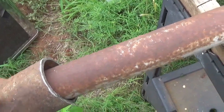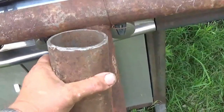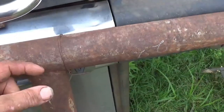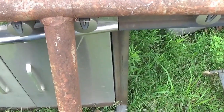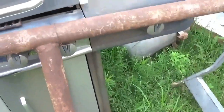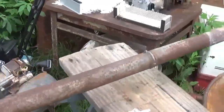What I plan on doing is where this is going to rest up in here, I may try to come out with a piece of metal — a little flange sticking out an inch or so — just to cover the pipe so water doesn't get down in it. But even if it does, down about ground level I'm going to drill a hole in it so any water that gets in can seep out.